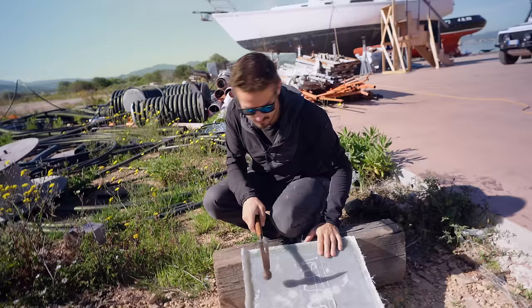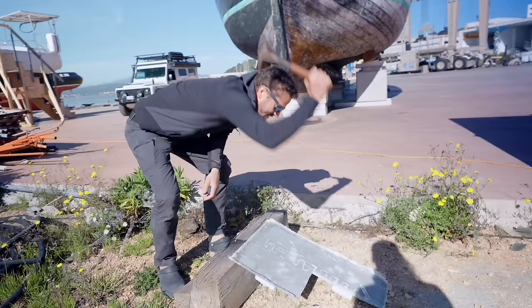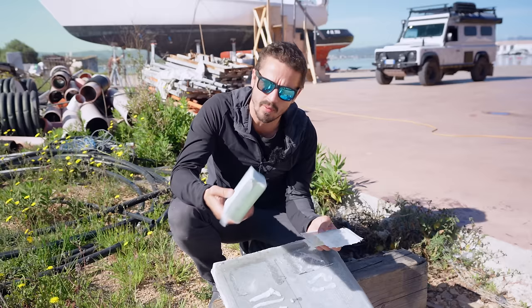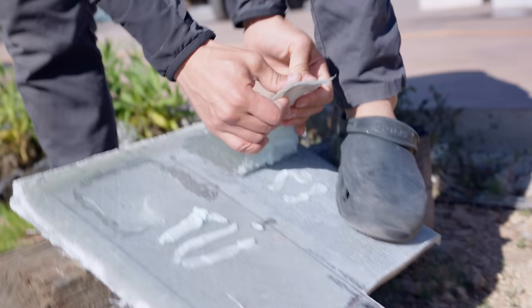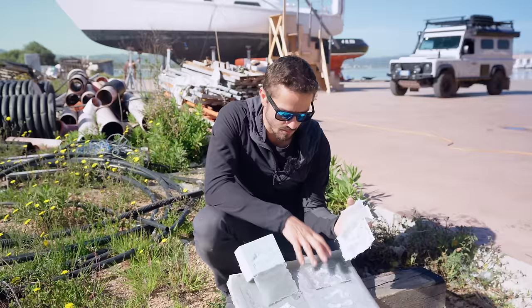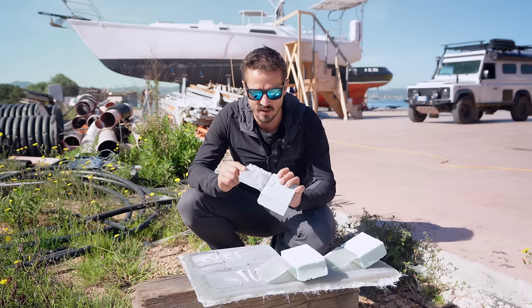This morning we're back at the yard to test round two of our glassing sample — time to hit some stuff with a hammer again. This is a pretty encouraging result. The peel ply sections and the part we didn't clean or do anything to popped off pretty similarly to our original test piece. But the part we cleaned with acetone first and then ground down ripped off just like it did inside the boat. That's a pretty encouraging sign. The interior of the hull has been ground down significantly, even more than this has been — which opens up a lot of fibers and allows the resin to really soak in and bond. Grinding and making sure it's clean definitely makes the biggest difference.